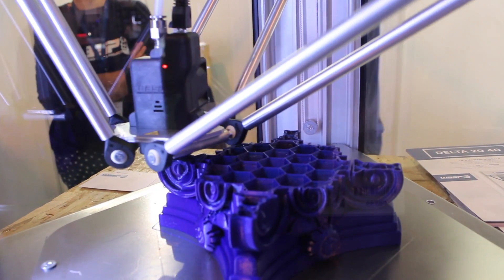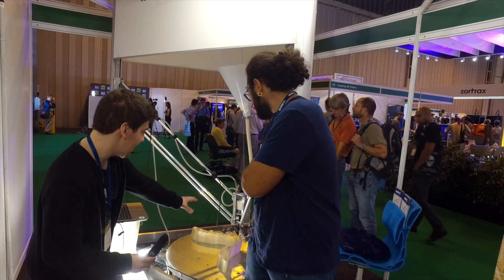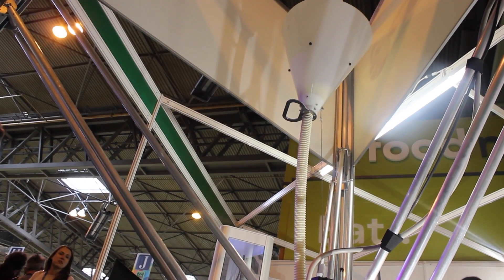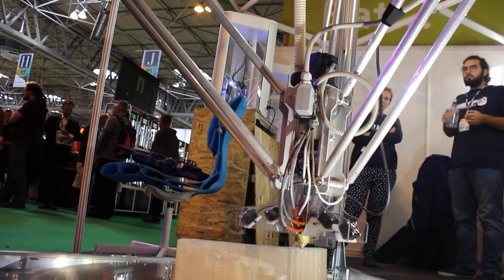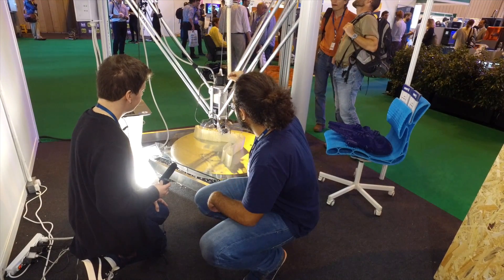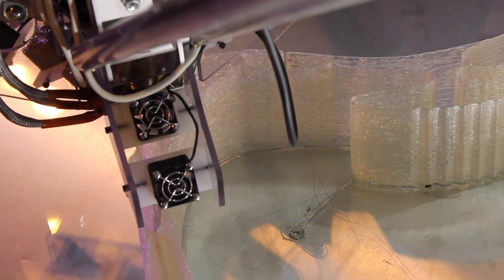Tell me a little bit about what's going on right here with the 3D printer — I know it's printing the chair over here. So you have a hopper in which you put the raw materials. The PLA right now is in granulates and goes through this tube into the chamber where there's a screw that pushes all the material through a heated chamber. The heated chamber melts the materials and pushes it into place, then you have a cooling system for the material when it's outside the extruder.